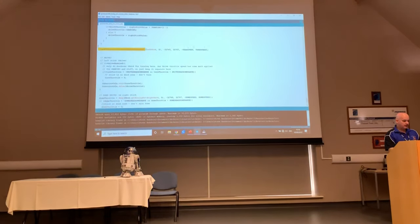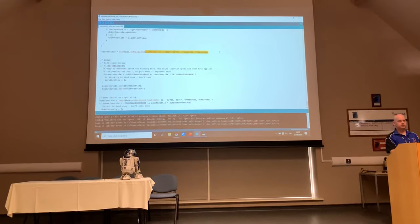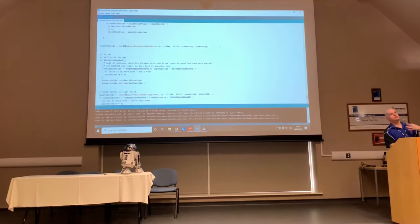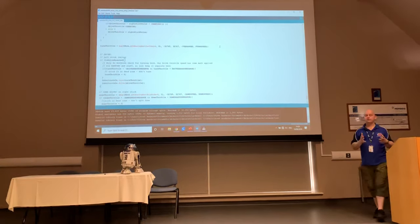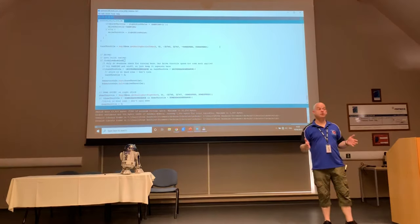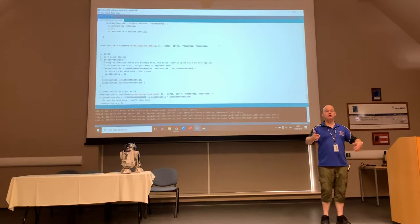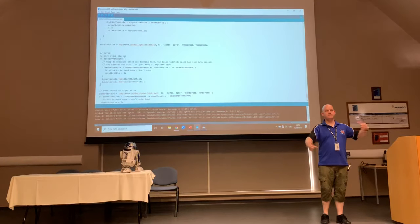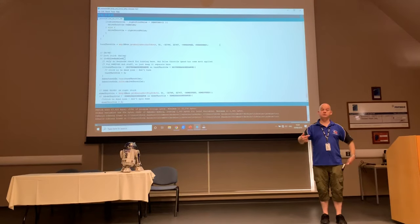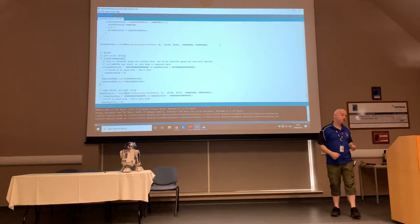Some of this stuff here is where the fix went in to fix the turning speed, so it used to turn faster to the right than it did to the left. Because the way that your Sabertooth is going to be configured is what's called tank drive mode. So it literally is driving like a tank. To turn right, the left hand wheel spins up, the right hand one slows down, vice versa. If you want to turn on the spot, you put one motor forward and one motor in reverse. Exactly the same as the leg points we were doing just before.